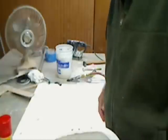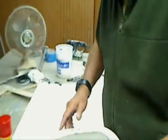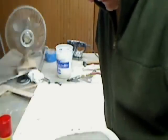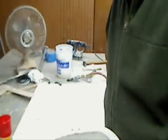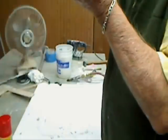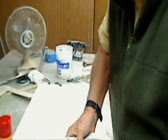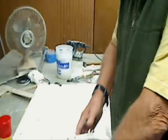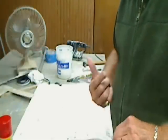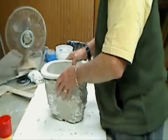Wipe that out, put a little clay in there, then give it a few coats of wax and some mold release, and we're ready to lay up a cowl. It should pop out just as easily as that did. You might want to drill a hole in the bottom here — drill one right through the center, put just a touch of tape over it, and we can blow air right from the bottom out to pull that cowl right out of there.